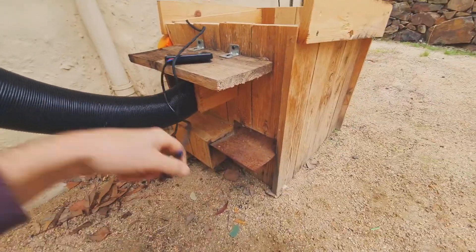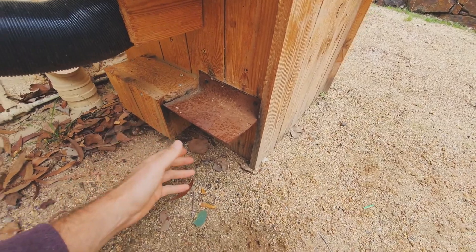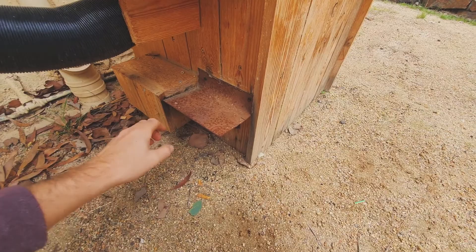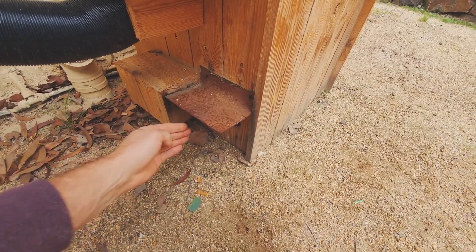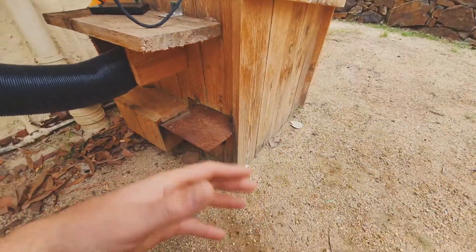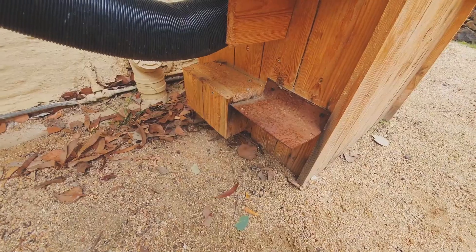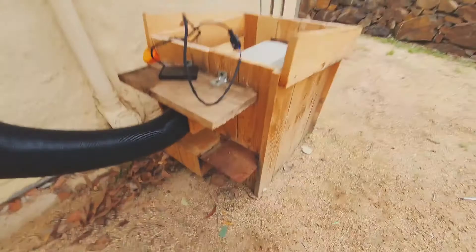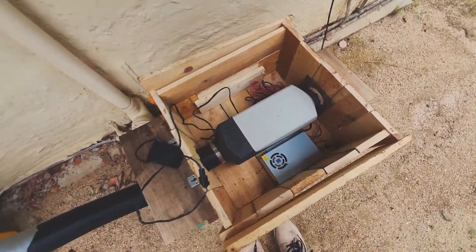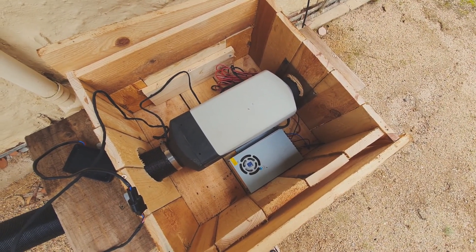The last thing I'll mention is the reason why I did this computer fan on the bottom to let air out: this is a muffler inside a wooden box that definitely heats up a lot. You can see a bit of carbon build-up but there's a lot of hot air coming straight out here. I just wanted to draw any trapped hot air out of the wooden box because I didn't want a fire at the back of the house. It's been working really well — this setup's been outside for about a year. I think we'll just leave it like that for today with the lid back on.